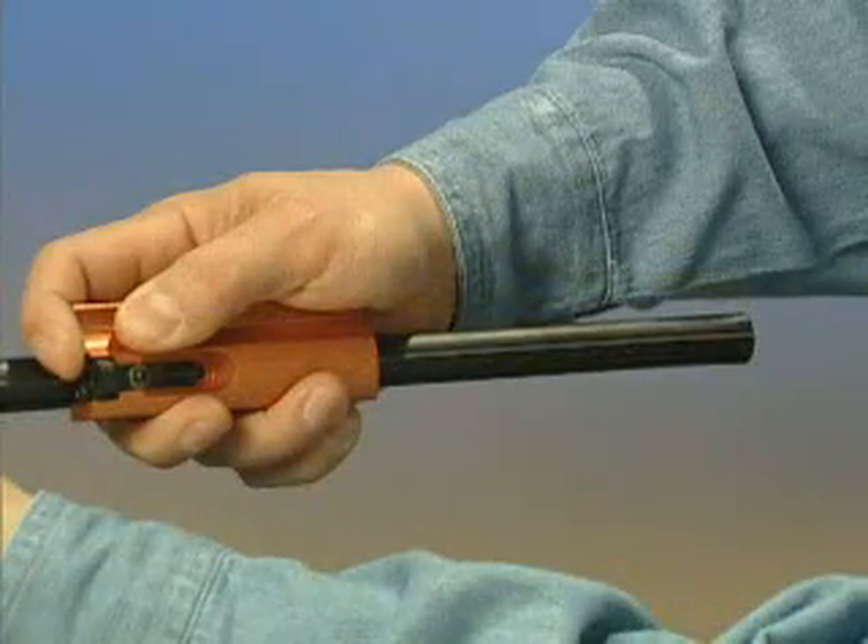Pull the tool slowly off the cable to remove the residual web. Place the tool upside down in your hand and place the shaving blade onto the residual web by lining it up with the slot in the tool body.